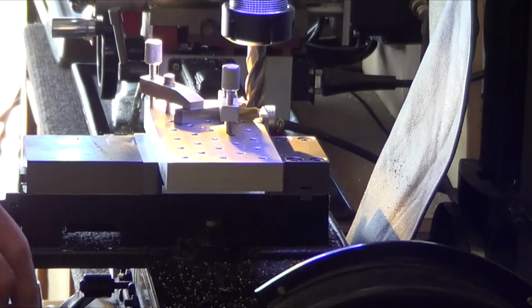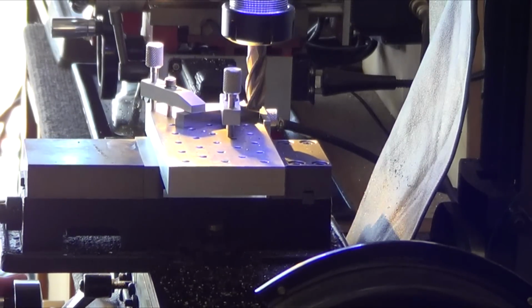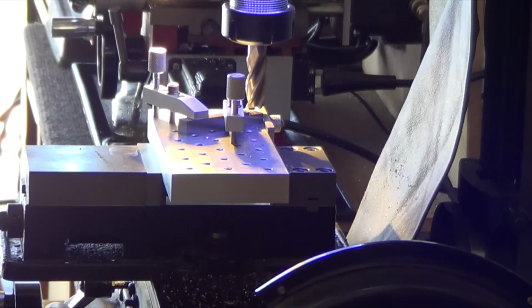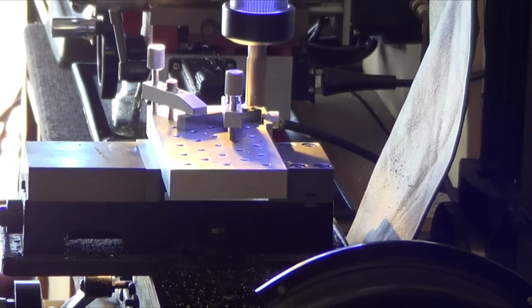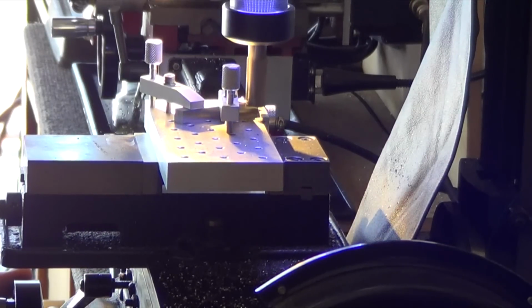That didn't look good. I need to make another surface cut. Back out from 14. Go back over. Come down 2 more thousandths. 83, 84, 85. Go back into 14, whoops, 20, 12, 13, 14. There, now that's making a good surface cut. Beautiful.